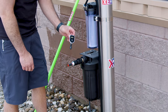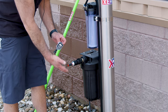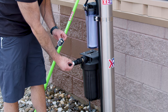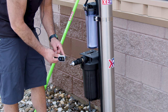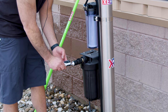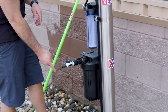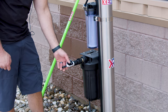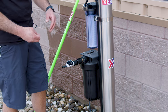Another place you can install this inline TDS meter is right at the outlet of the system. If you're using the supplied fittings with your Zero water-fed pole, all you want to do is remove this push fitting — there's a nice barb right there. This is the same exact size push fitting that's on the TDS meter, so just leave it right over that barb and you're good to go. Put your pole tubing on the other end and same deal.